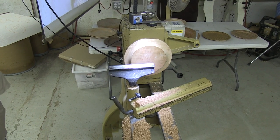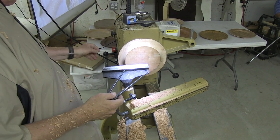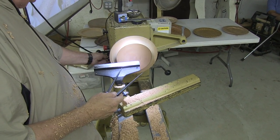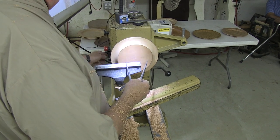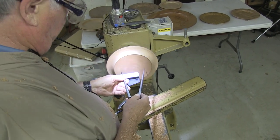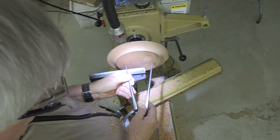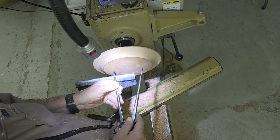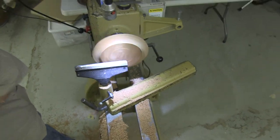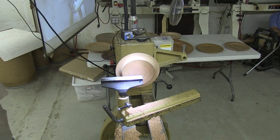So now I'm going to make the mark for my chuck. And I've set these dividers pretty close to a closed chuck diameter. Probably going to turn this down because it's not going to be flat, so it'll be harder to make the point right. Okay, I know which one that's going to be. Obviously, when you do that with the dividers, you can't let the far side drop.